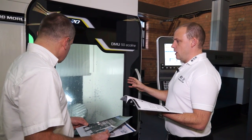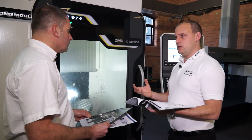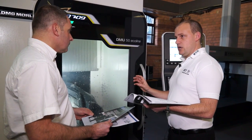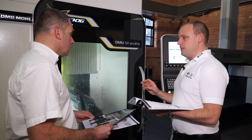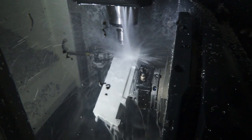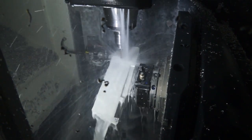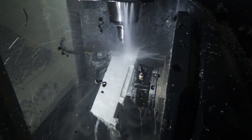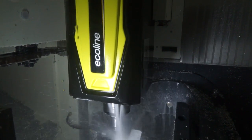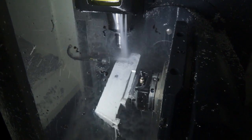If you looked at this type of machine as to what it could do for you — whether you're machining or cutting aluminium components, so softer materials, or whether you're looking at doing more demanding work on harder materials — this machine is capable of doing that. You have a standard 8,000 RPM spindle, but you can go for the option of a 10,000 RPM spindle as well. With 8,000 you'd normally associate that with a little bit more torque, then if you wanted 10,000 you could do some more high speed machining. The machine here, as you see it machining, has got the 2-axis table, which is the 5-axis. It's positioned now so we're machining the side of the component.